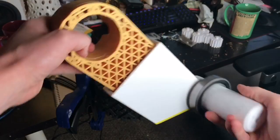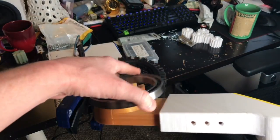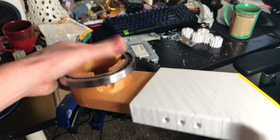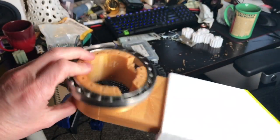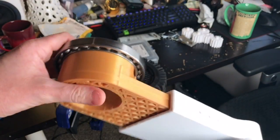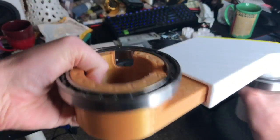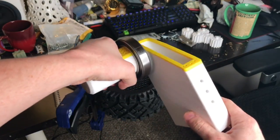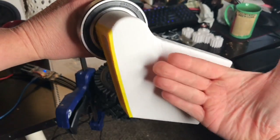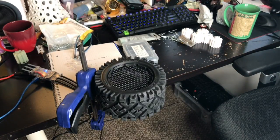I'll show you a little bit more about the design here. That assembly that's clamped is one of these plates — this is the plate that's clamped over there. The bearing for the wheel fits over there like that. This is an unshielded bearing, but I'm using shielded bearings in there. The motor wires come out in either this orientation or this. I use a plastite style screw for all the assembly, so there's no nuts — just screws. This slides into this part. This mounts it to a chassis, so the wheel goes there and then some suspension will be figured out to go to the chassis.